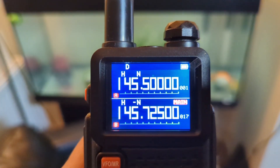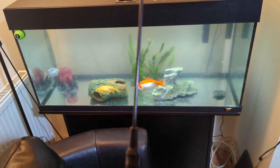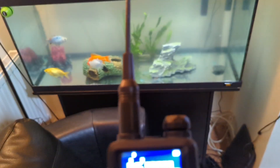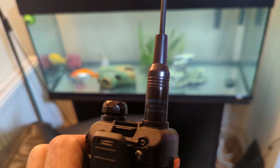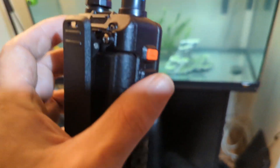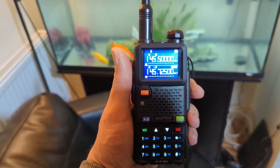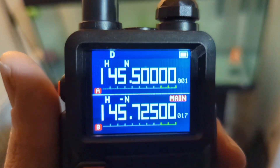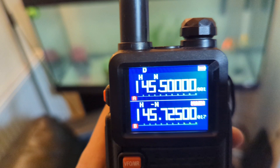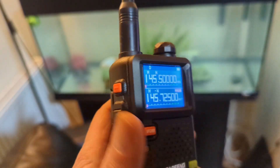I like the screen. I made a video last night of it receiving the International Space Station and was really impressed with the quality. We're only running this antenna — by the way, this isn't the stock antenna; the stock antenna is half the size of this. This is just another Baofeng product. Good reception quality, great speaker — the audio quality is superb. The antenna on this one is the NA-771, and again it was cheap as chips. I love the feel and the look of it. The screen is a big reason I got it, as my eyesight isn't as good as it used to be. Working the satellites with my Arrow antenna outside, it's going to be pretty nice. The signal meter is really cool — you've got two separate signal meters, one for each VFO, giving you a quality reading with an S-meter style display.